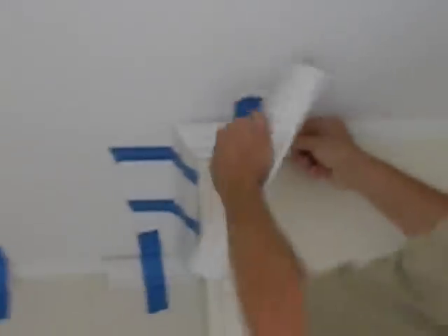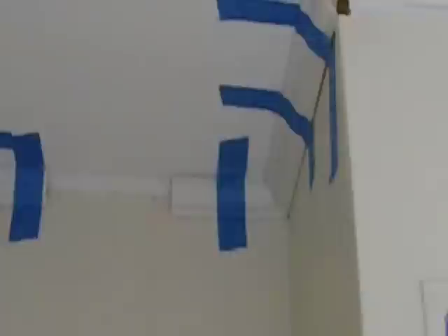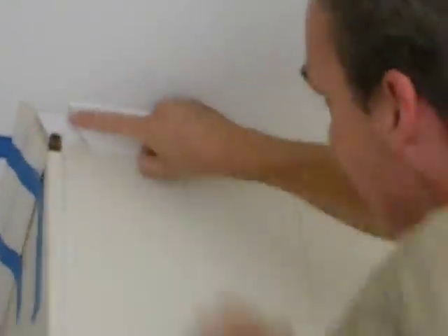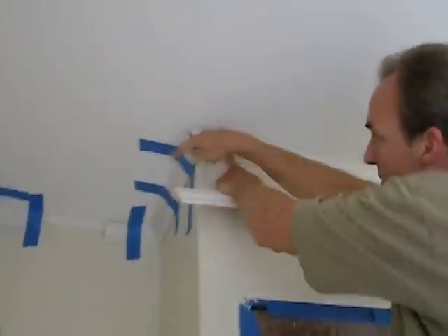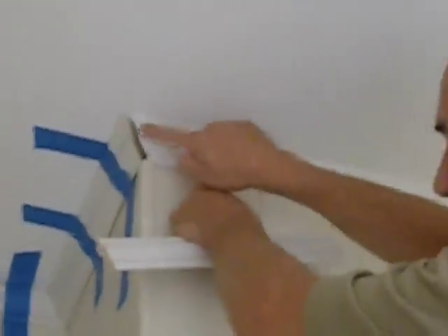Here's how an outside corner works: on an outside corner, the top piece is taller than the bottom piece. You've got to get that right. The second thing is you've got to make sure that you cut it like that, rather than like this. Here's how you remember: if you've got a daughter, don't let your daughter go outside — outside corner — in a high skirt. The top is high.